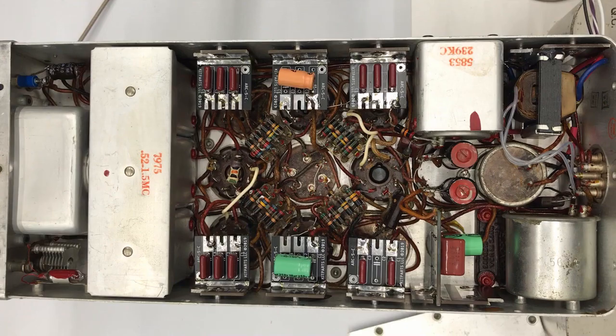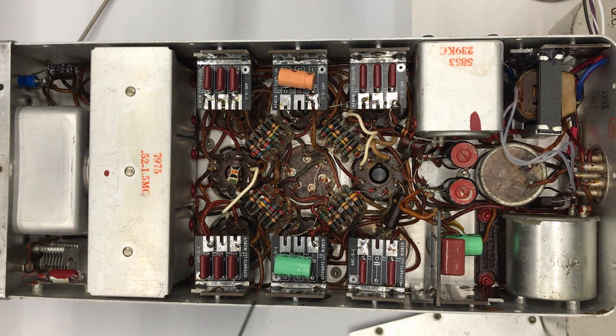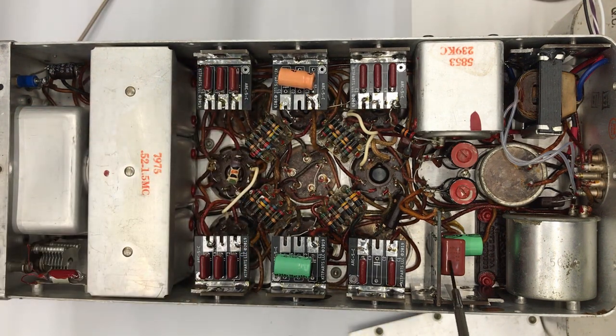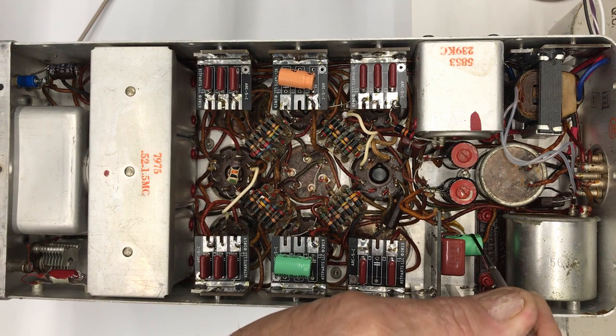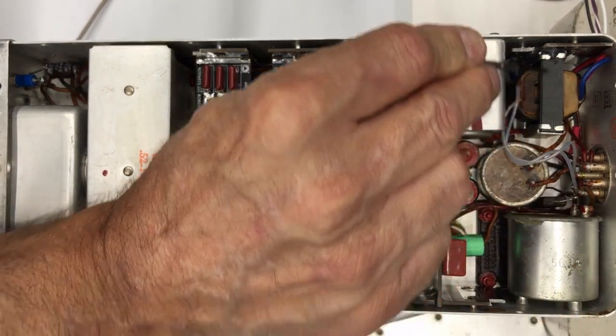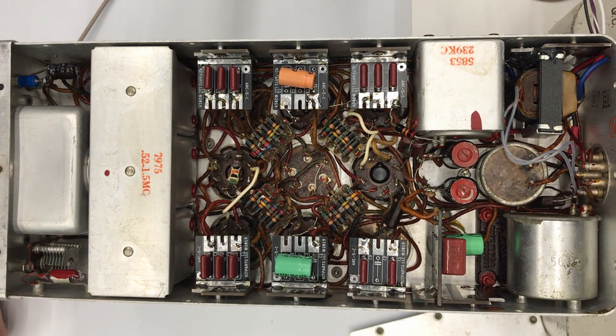This last view is the modified radio. You can see the 0.1 capacitors throughout. I found that with the inverter, a slightly larger capacitor on the B-plus side is helpful. This is the cathode bypass capacitor. In the back you can see a larger capacitor where a 0.22 used to be — we changed that out to a 10 mic, which makes the B-plus nice and quiet. Left the original filter. Here's the new audio transformer — fits nicely in and reconnects to the outside world. That's my modification. I'll provide all of these parts for you to do the same, and hopefully we'll get some of these 75-year-old amazing radios back on the air again. Thank you.